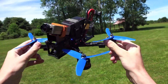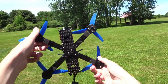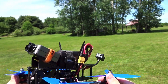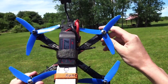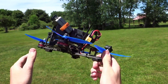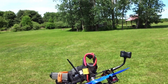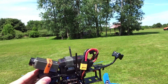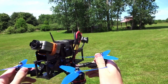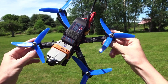So there we go — that was my quick little line-of-sight flight with my ZMR-X210. Pretty powerful little machine. I'm pretty happy with it right now. The frame could be improved a little bit, but motors, ESCs — they're tested and proven. Props are working out pretty well, as well as the battery. My motors feel a little bit warmer than I'd like — they're not hot, but they're definitely warm, and it's not that hot of a day, probably 80 out right now, so I might have to check my tuning a little. Battery's just warm but no problem at all. Please subscribe if you weren't already, and I will see you in the next one. Bye.